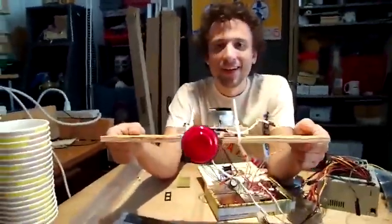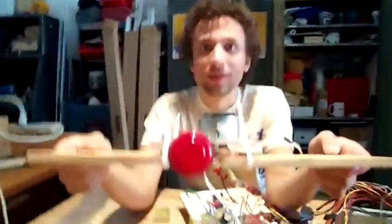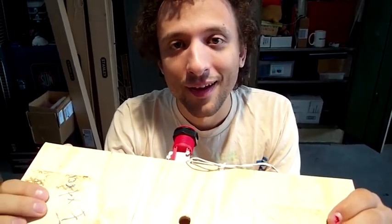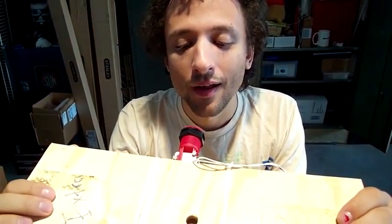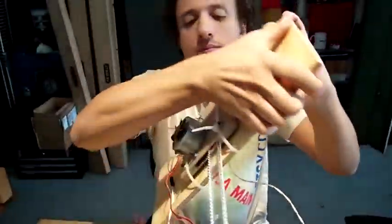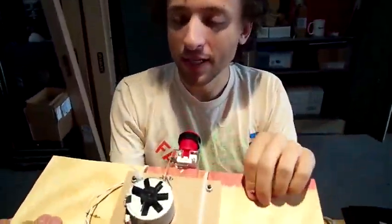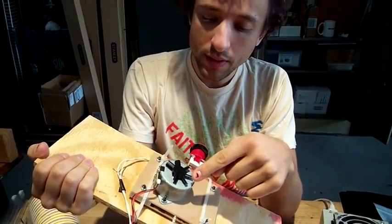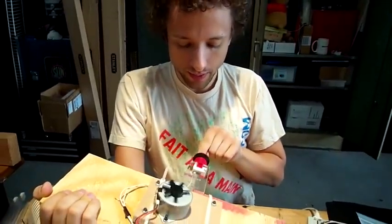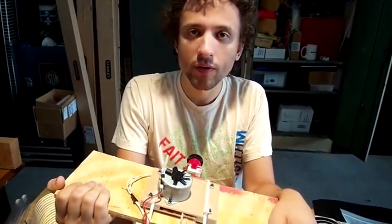What do you call this? I call it my probe. Right now it's measuring how far it is from where it stops to where your nose is. There's a stepper motor in here. The stepper motor goes a certain distance for every step that you've commanded it to go. You just keep on sending steps until this button gets pushed, and then it knows how far it's gone.